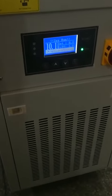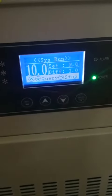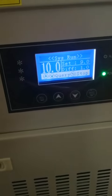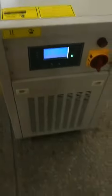The chiller has started working. The chiller temperature is set to 9 degrees with a temperature difference of 1 degree. The chiller water temperature is now 10 degrees and it's going down — that's a positive sign.